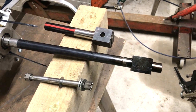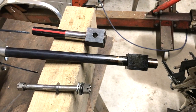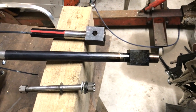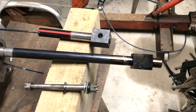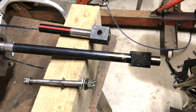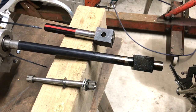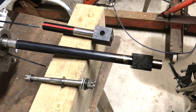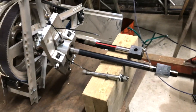The only slight concern this time is that I got it a bit hotter than last time, and if too much heat has been transferred into the shaft — which is EN24T — then it might have affected the temper or case-hardened it. That could be a problem. I might have to use a carbide cutter, but we'll see what happens. Otherwise it should be okay.